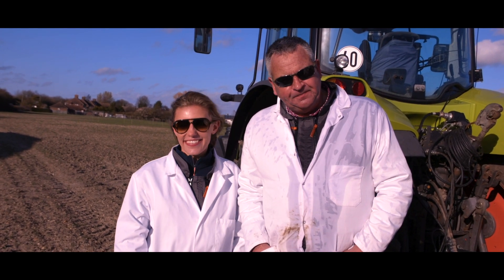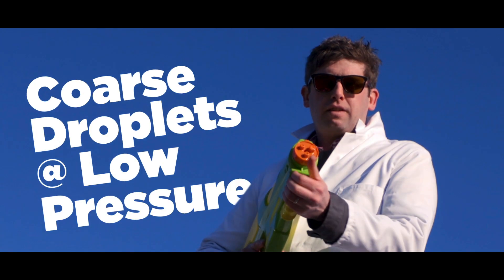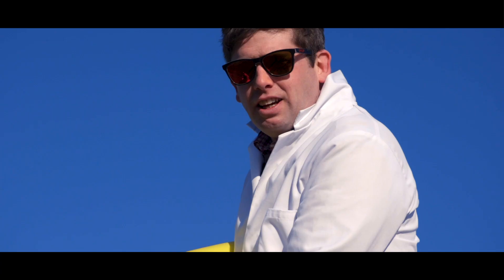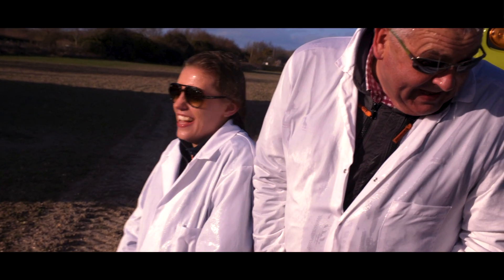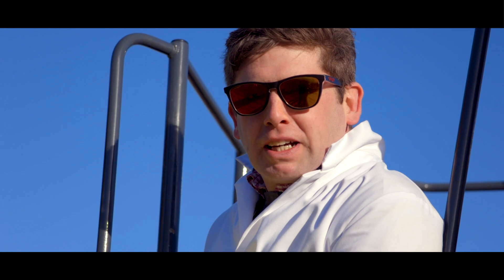So now we're going to use a coarser droplet and drop the pressure. As you can see, with lower pressure and a coarser droplet we can hit the weed. And we adjust the angle of touch — bang on target.